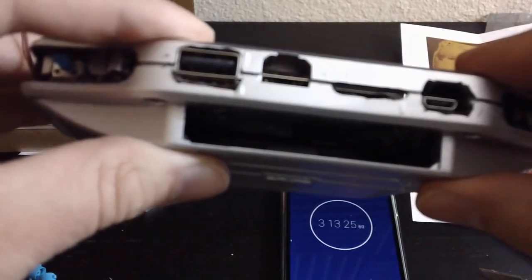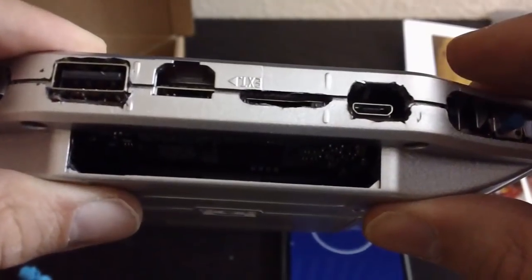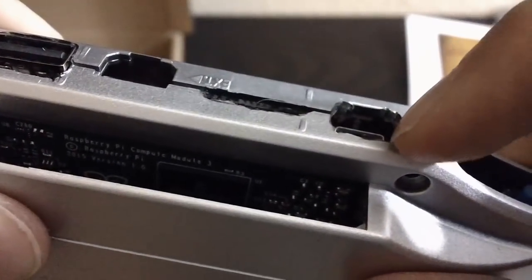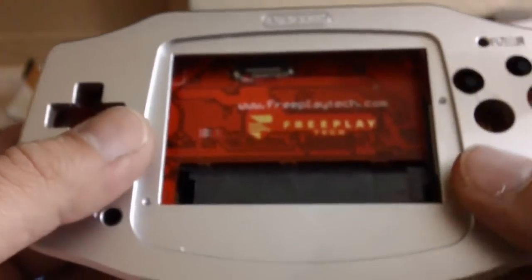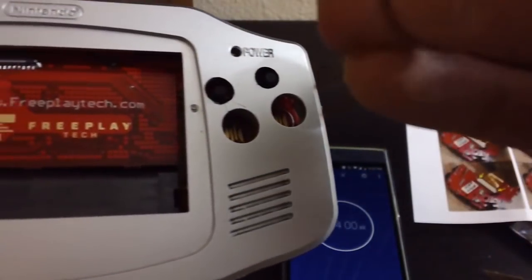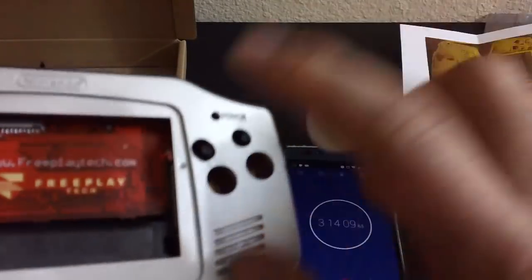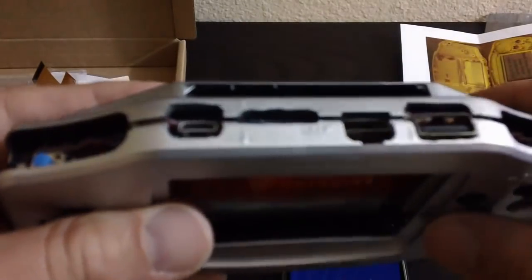I think I'm ready to start screwing things in and it seems to be fitting together pretty well. There are big holes everywhere that the next time around I'm going to know how to cut better. With micro USB you don't need that much space. The full size USB is just sticking out flush. I'll try to go with the Dremel and make it a little bit smoother. If the button hole isn't perfectly centered, it's constantly on — it just always registers as pressed — so you've got to make sure that you get it just spot on.